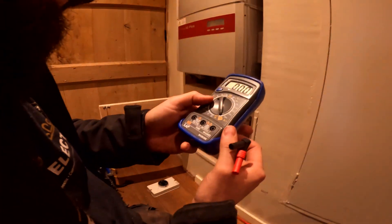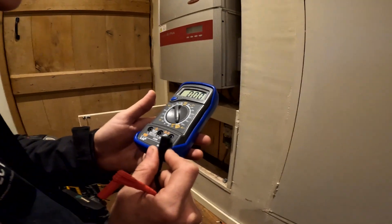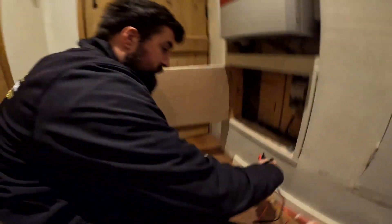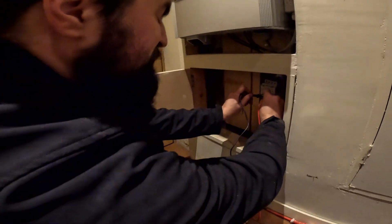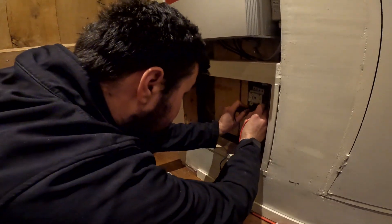Now there's a little isolator, DC isolator. I'm just going to check there's power here. So it should be pos neg, pos neg. Here's my little multimeter. We'll bang it on amps - it measures up to 10 amps. Red in here. We're just going to test, see if we've even got any solar. This will actually send the current through this, so we might get a little flash when you do this. We're not getting output on that one. Look at that - this panel's knackered.